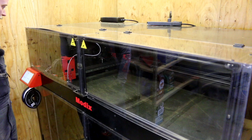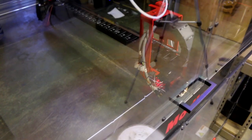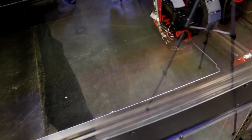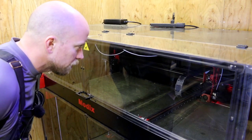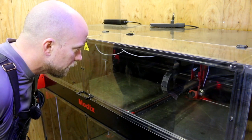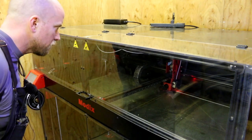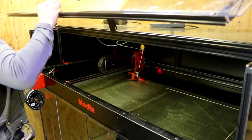The G-code has made its way to the printer and we're about ready to see some magic happen. Filament is coming down — wow, a lot of material going down. I'm already concerned with those little loop-de-loops there. It looks like it's just not adhering to the bed as well as it should. That back line is a lot straighter — oh yeah, we got a problem. Pause.